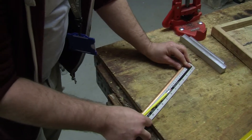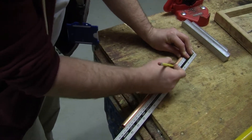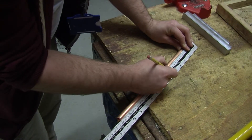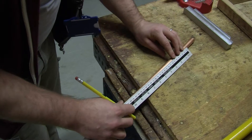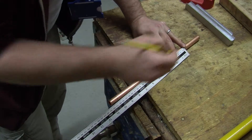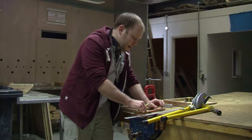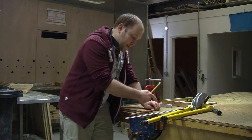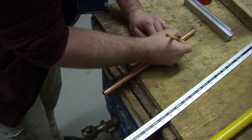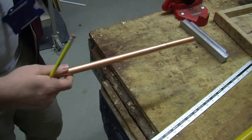As an example, we are going to measure and bend this pipe at 150mm to a 90 degree. You'd measure out the distance that you want to bend — in this case 150mm — and measure back 70. So if you measure this way, you measure back that way; if you measure this way, you measure back this way. By measuring back, you always measure back the way you've come, because people always get mixed up with that. This mark then goes on the shoulder of your former on the bending machine.